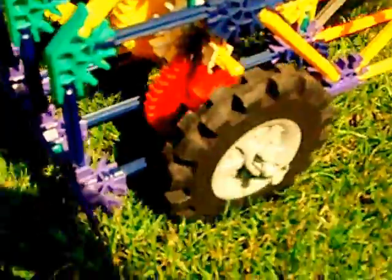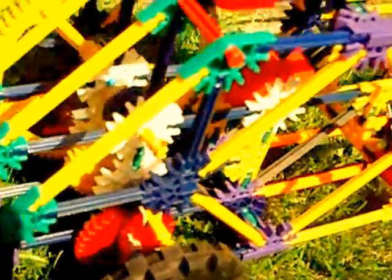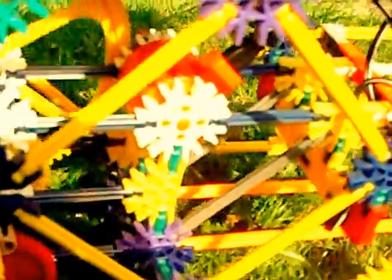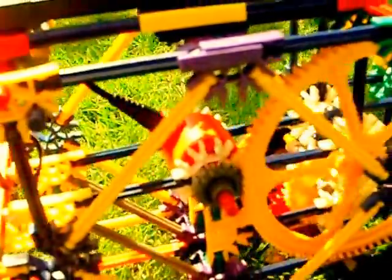As it's gone onto the difficult ground, because the power of the front motor is limited by the solar panel, it just slows down and stalls out. It holds it back, and because the motor there is stalling, this one engages and because of the much lower gearing it has much more power. You can see the front motor is all but stalling because it's for high gearing.